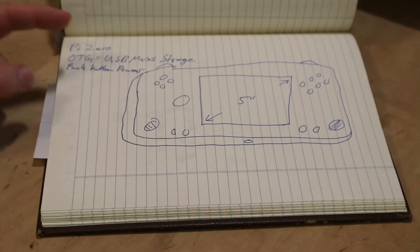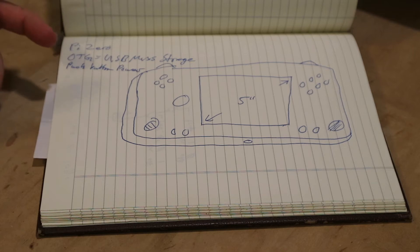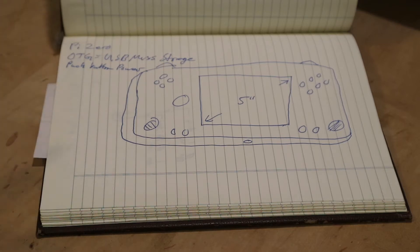I'm just going to use a tactile switch to power it on. I'm going to program the DT blob file so that one of the pins will go high as soon as it powers on, so that tactile switch will power everything on momentarily. The GPIO will come on and BAM — power. Then when you shut down the unit, GPIO turns off and everything gets cut off of power.